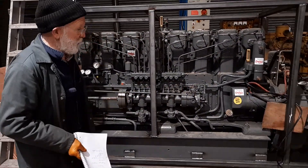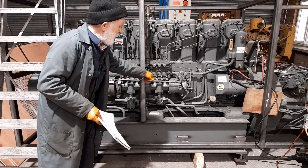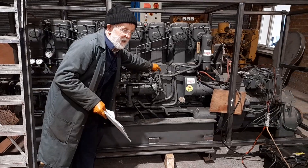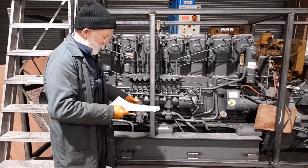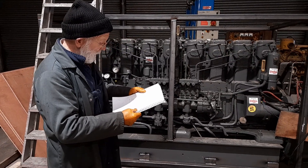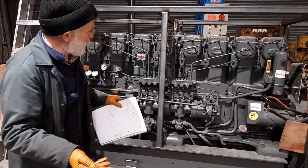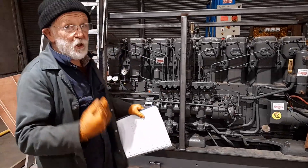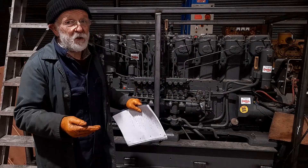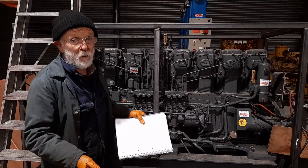There's no turbocharger — it's a naturally aspirated engine. You've got the latching levers as you have on the 6LXB. The rack and cam box works the same as the other Gardners; there's no difference there. Like all the Gardners, the engine is under-stressed, it's low revving, it doesn't get any hotter than 60 to 65 degrees C, and the maximum RPM is 1300.